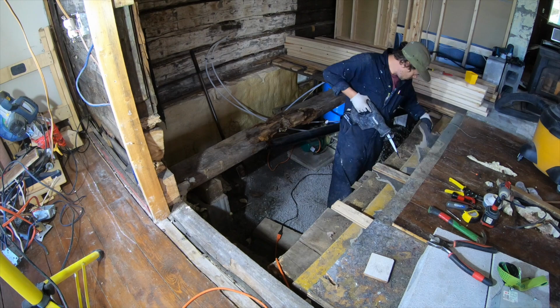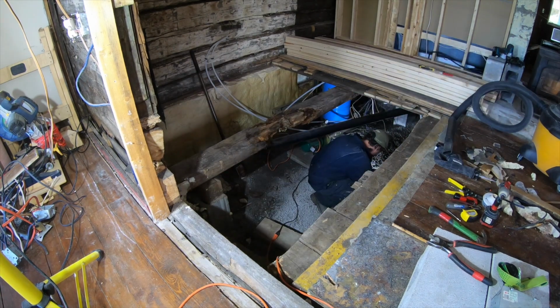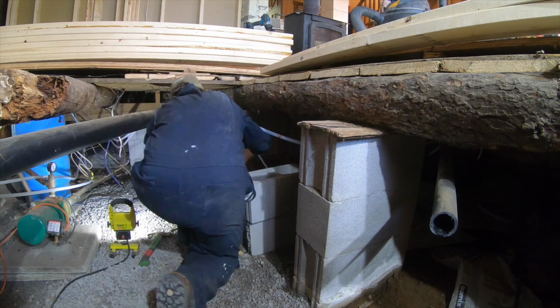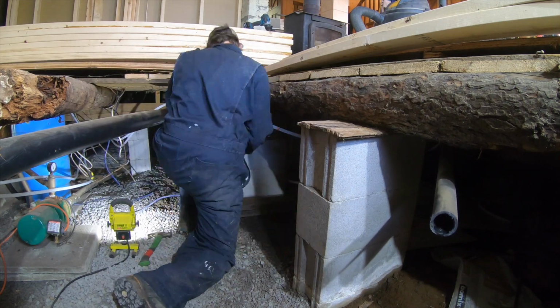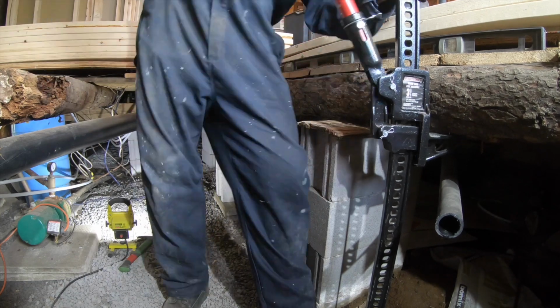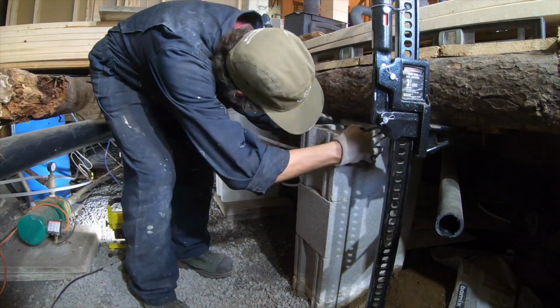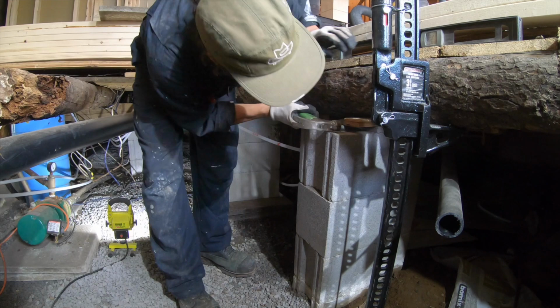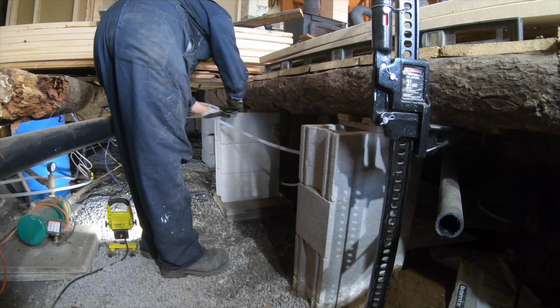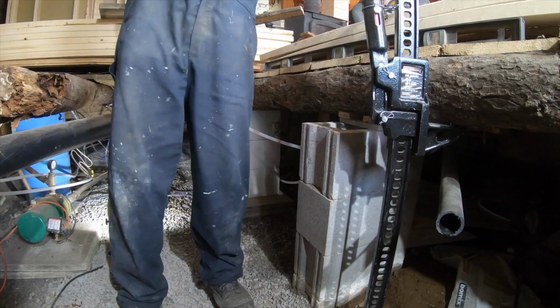The first thing to do in the kitchen was obviously to rebuild the floor. As you can imagine, what was left of the original floor was far from perfect. It was saggy and bouncy and not even close to being level. So in an effort to give it a little more sturdiness and make it easier to merge the new section of floor, I added a few more support columns and shimmed the original beam to a somewhat acceptable level.